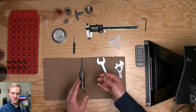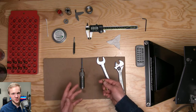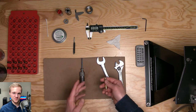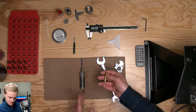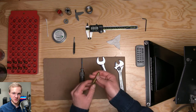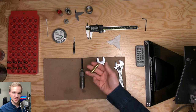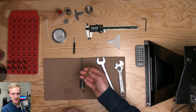If you're plus or minus about a thousandth, I don't want to go negative two, but if you're like negative three to maybe five or even six thousandths, that's okay. You do want to be careful not to overwork your brass — ideally it's nice to have brass last as long as it can.